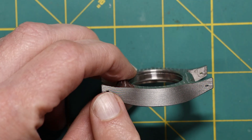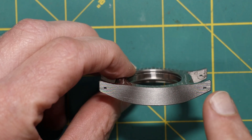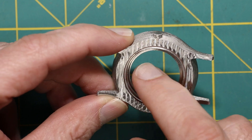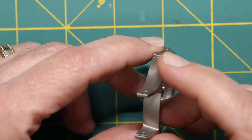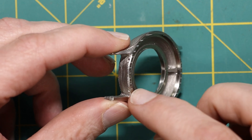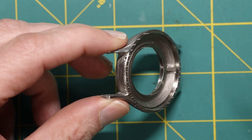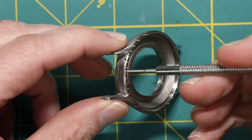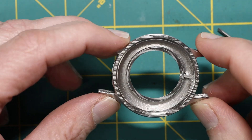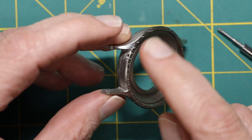Looking at the final results, the lugs are really hard to tell apart — they felt different while in the milling machine but I wasn't completely sure. Looking carefully at the ring inside, I might have noticed it was off-center, but it was subtle. Where it became very clear was when the part was flipped over in the machine. On this side it clearly gouged the part — there's a chamfer here that shouldn't be there, and two gouges. Whereas the other side is very clean, which is what I'd expect. So it was very clear after all the milling that it was not correctly positioned.